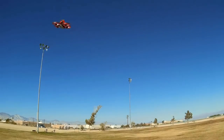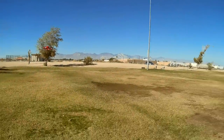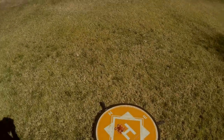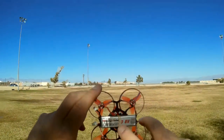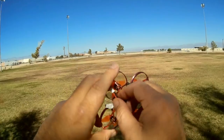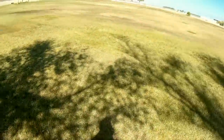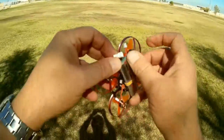Let's bring it up close to show you that LED — see if you can see it underneath. Let's put it on the pad and switch to air mode acro. These are the batteries you get with it — a Happy Model 450 milliamp-hour, 3.8V HV battery, a high-voltage cell that charges up to 4.35 volts. Let me get my transmitter on, switches up, then plug in the drone battery and put on my goggles — we'll go fly.